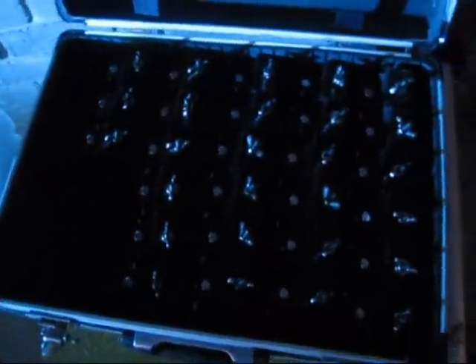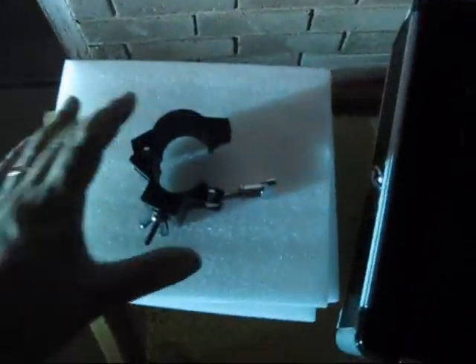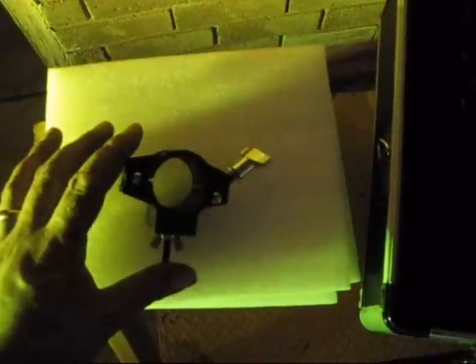Here's my collection of 30 inch and a half O clamps. I very particularly enjoy O clamps versus C clamps because they don't tear up the pipe. With C clamps, if you're going to have any significant amount of weight on there, you have to really crank down on the tightening bolt, and that can scar the pipe, deform the pipe, or just tear it up.